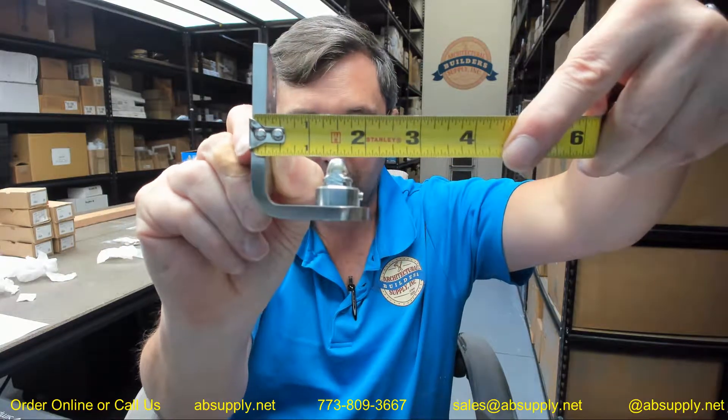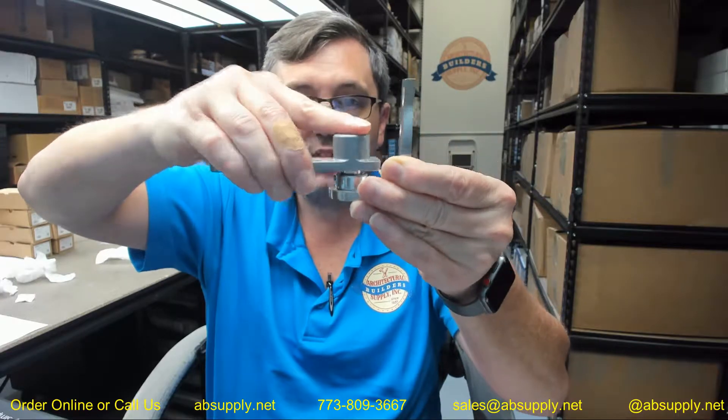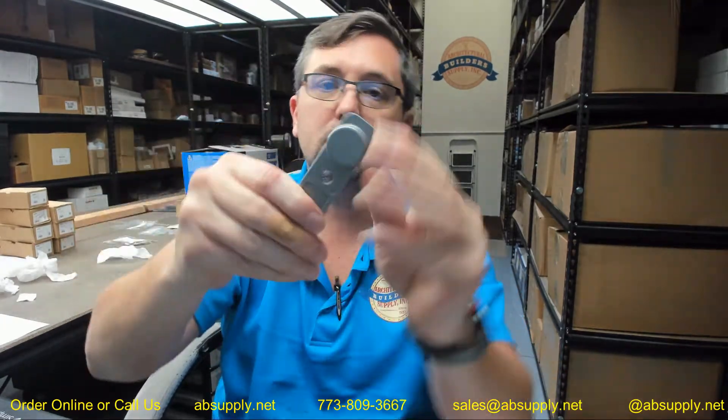About two and an eighth inches overall. From the jam to the center line of the thrust bearing, it's coming up an inch and a half. That dimension doesn't really matter because your door is going to be hanging over that area as well, being a center-hung pivot. Working our way up the door, you're going to have the door portion that sets right down into there. Dimensions of the bottom arm: overall length about four and three-eighths, overall width one inch, thickness of that plate is one-quarter inch. You'll have to drill a little area for the boss for that to rest into, provided it's a wood door.